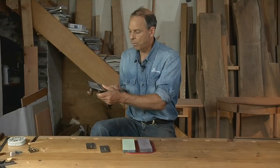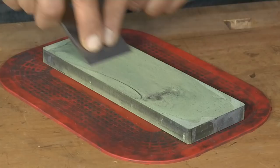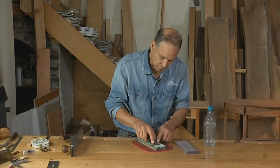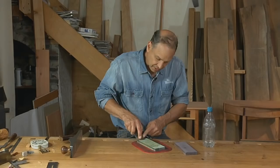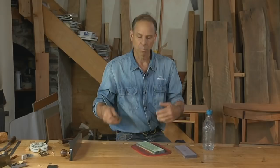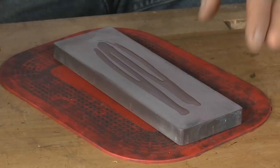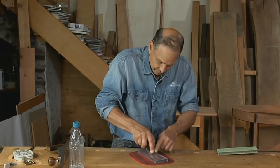I'm going to sharpen normally up to about 4,000 or 5,000 grit, and that's where I would change and actually put a micro bevel on — a very small bevel along the edge. The nice thing about a micro bevel on a bevel-up plane is that when you're done using it, you can easily erase it by a very small amount of grinding or just hone it regularly. On the 5,000 grit stone, I'm going to start with somewhere between a 5 and 10 degree micro bevel — I'll rest it on the bevel, raise it up a small amount, and hone it at that new angle with my arm locked in a comfortable position.